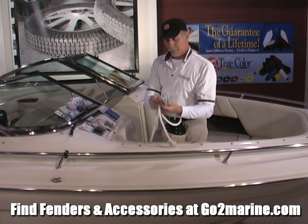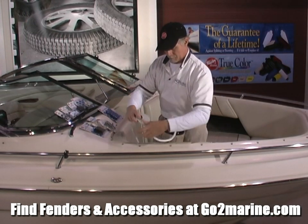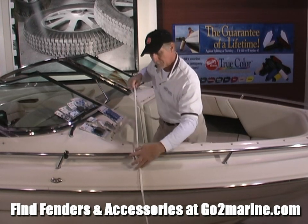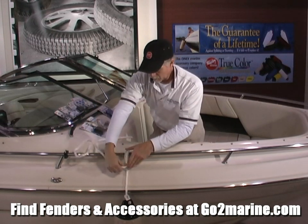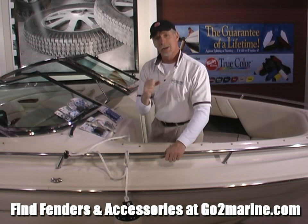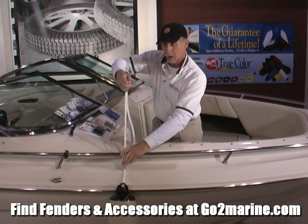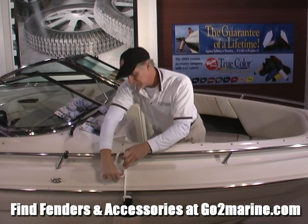You take your fender rope, thread it up in, get your fender in position, hook the adjuster to your rail, pull the fender up to the height that you want to adjust it at, wrap the rope down through and underneath, and the teeth in the adjuster are what grab onto that rope and hold it into position. Now to readjust, simply pull the rope out, adjust your fender up or down, re-thread back into the hanger to secure.